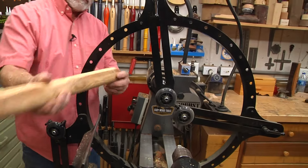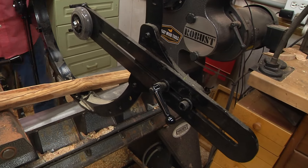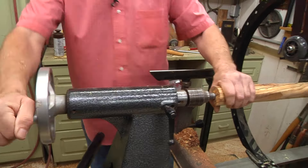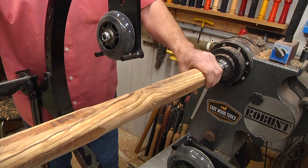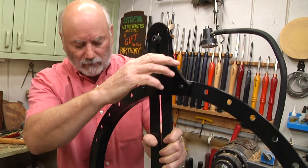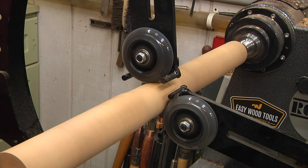So we're going to bring our blank back up here, get the right end in the right spot. I'm going to adjust this arm up just a little bit to get it out of the way. I put these arms in the position that worked best on the last rolling pin and I'm putting this back on center right here. You can see I didn't quite round this out all the way — I only rounded it out in the center because I was getting a lot of vibration. This is where this comes in really handy. I bring the arms up with a slight amount of pressure so they're touching and the wheels turn. Now I'm pushing against the wheel so there's no flex and no vibration.